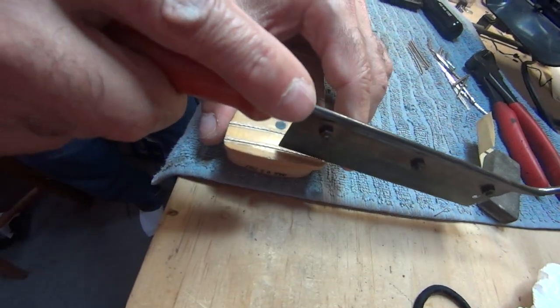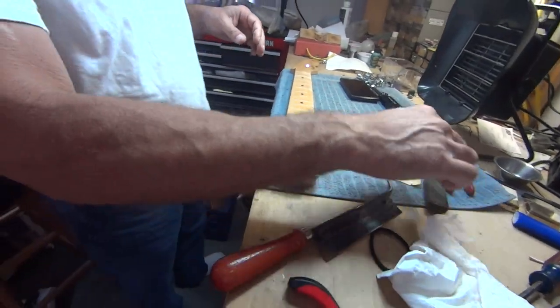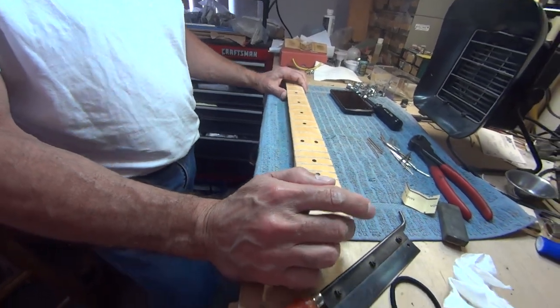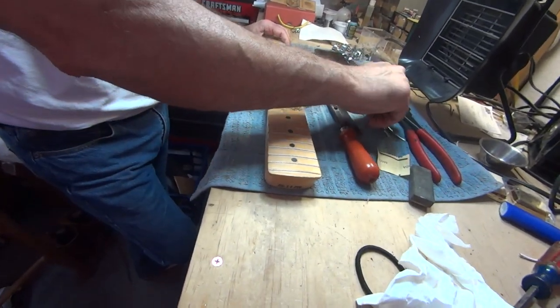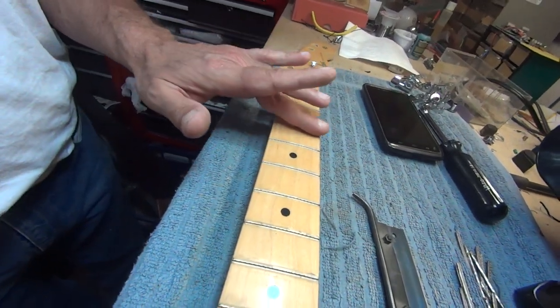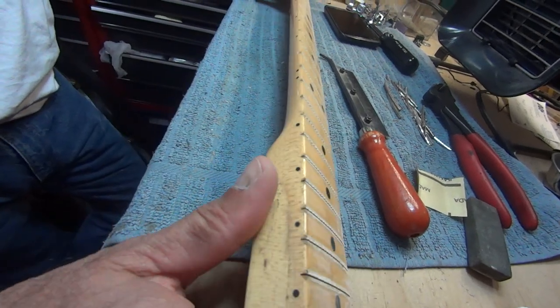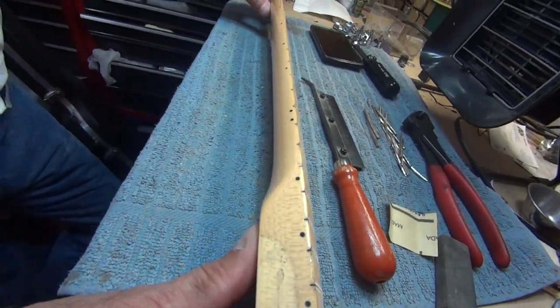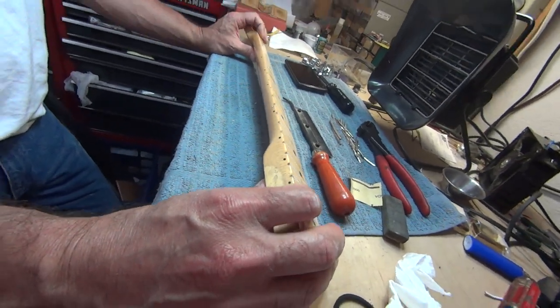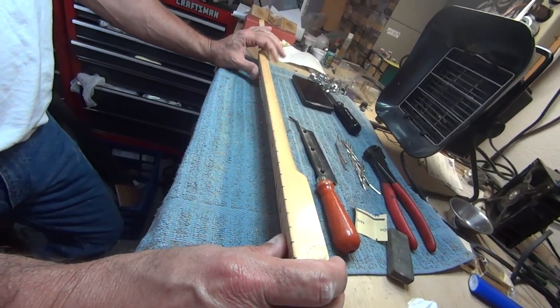Don't overthink re-planing every neck — as a matter of fact, on a vintage guitar if you're planing the neck you're an idiot, because you should leave that alone. You take somebody's very expensive guitar and ruin it — all those finger grooves in an old neck are there as the test of time. All you want to do for cleaning is clean the surface where the frets go. Unless the neck is way up over here and way up over here, in that case you'd probably just throw it away, because if you have to plane it that much it just isn't worth it.